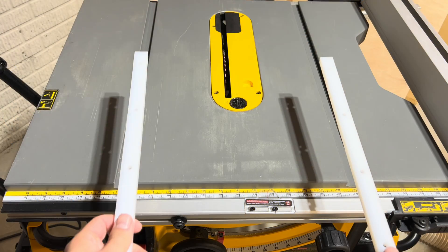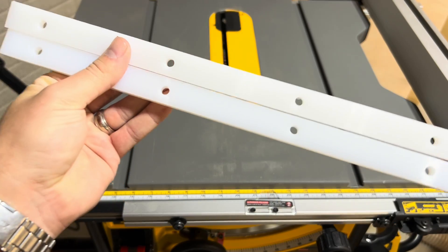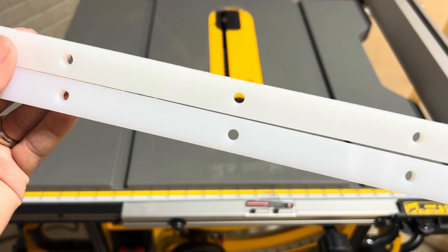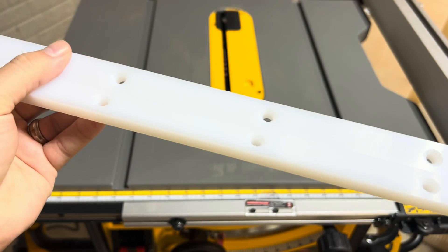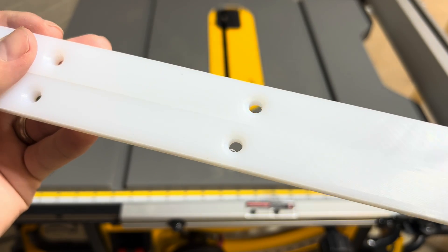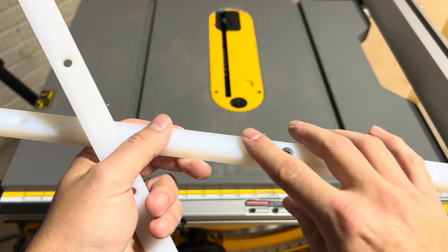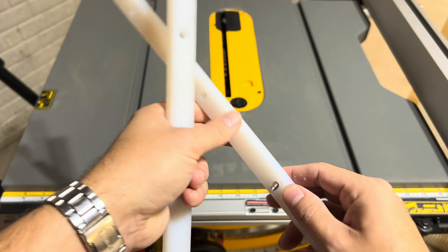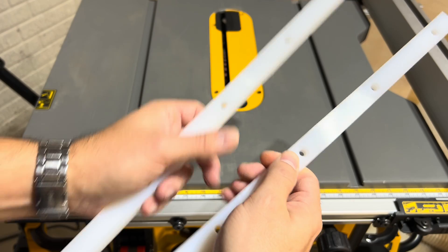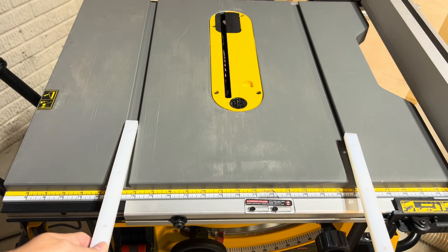For the slides I prefer UHMW material. I purchased pre-made runners — I'll provide a link in the description below — instead of building wooden ones to save time. They won't swell or shrink with changes in weather causing the sled to have too much slop or be too tight. Some may choose to cut a plastic cutting board, but these arrive pre-drilled with holes countersunk to avoid fitment issues along with the hardware screws needed ready to go. This type of material makes the sled slide smoothly.